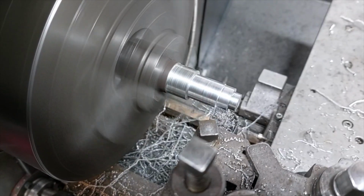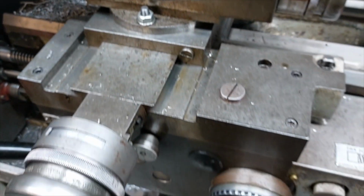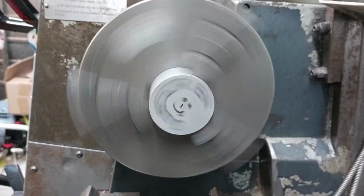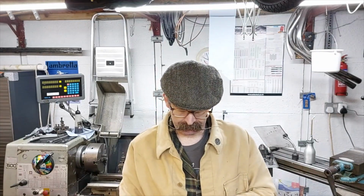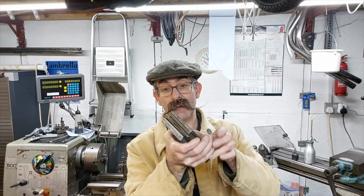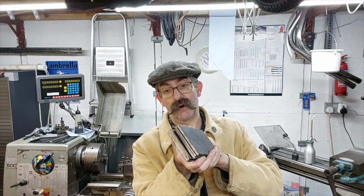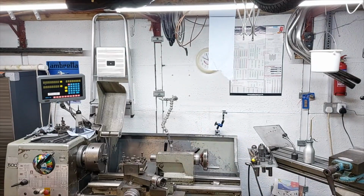The steel plates are just a bit of, what is that, 2-3 mil steel. Hang on, I'll measure. Yeah, 3 millimeter steel plate. And these I got from our local steel supplier. Quite handy, they do shim packs. They do these steel shim packs, which is a selection of different sizes of flat plate, normally two of every size. And it's proven to be really useful. So two of these plates made the sides for the trolley.